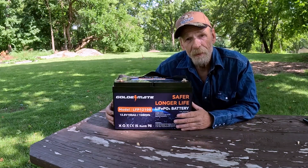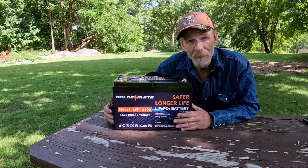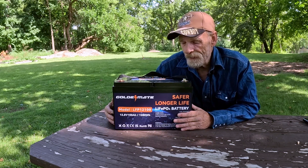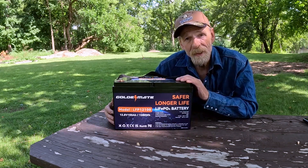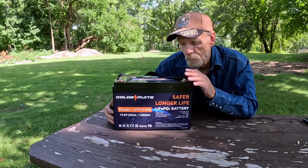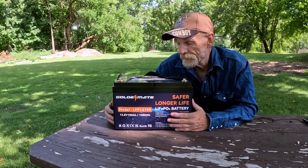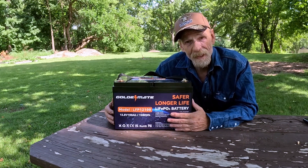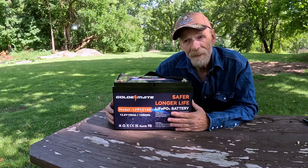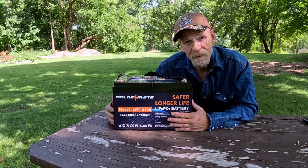If you need to plug in AC power, you need an inverter — you connect the inverter to the battery terminals and all your plugs are on the inverter. I personally use a 1000-watt inverter. When fully charged by the sun and brought inside with the AC inverter, I can run my refrigerator-freezer — about a 150 to 180-watt unit — for a good five or six hours.